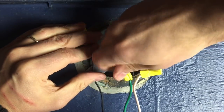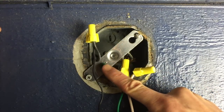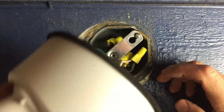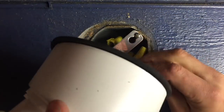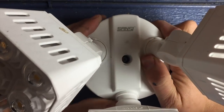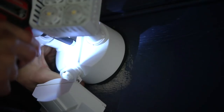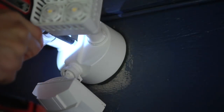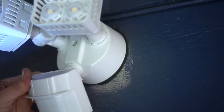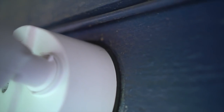Also, as a side note, I have a ground wire coming out of the box, which is why I don't need to use the ground screw — I already have a ground wire coming out. Now in some cases, due to the age of a house, you might not have that ground wire coming out of the box itself, but I do. After that, go ahead and push the wires back into the box and screw the center bolt into the mounting bracket. That will secure the entire unit to the wall. Make sure the gasket is all the way around, and that you have a nice tight seam at the top to make sure there's no moisture coming through.